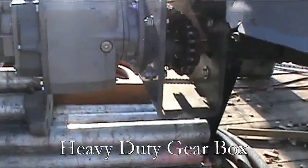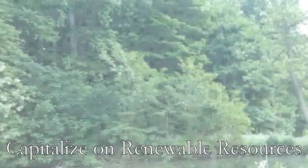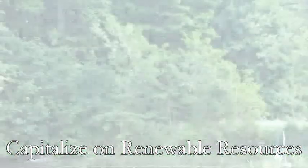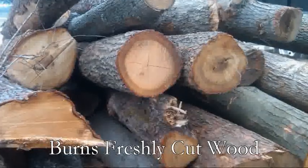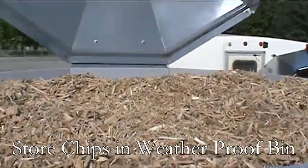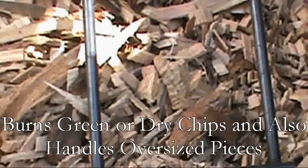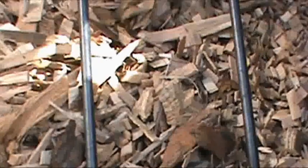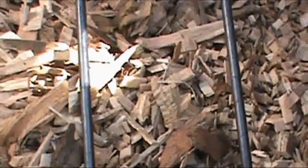This is the same design we have used on our coal and pellet boilers for several years with no problem. Take advantage of local resources such as wood chips which support the local forestry industry and make use of a forest byproduct. Although we can burn quite a variety of wood chips including some overage, knots, and smaller branch pieces — which eliminates the need for screening — the ideal chip would be in the one and a half to two inch size range.